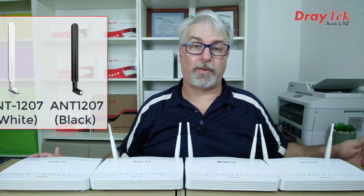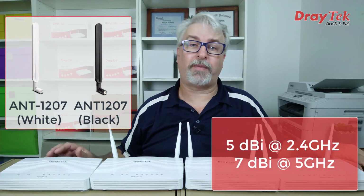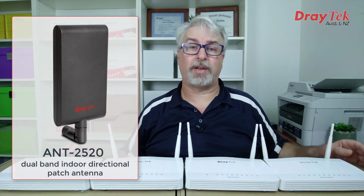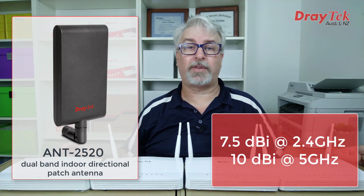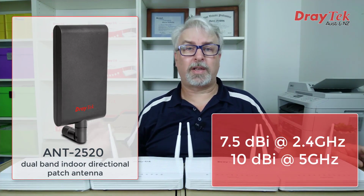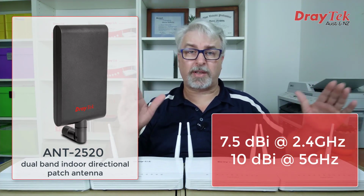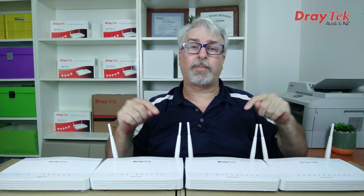DrayTek have the ANT1207 antenna available as a straight screw-on upgrade, which steps the gain up to 5 dBi at 2.4 GHz and 7 dBi at 5 GHz, as well as the ANT2520 dual band indoor directional patch antenna, which steps gain up even further to 7.5 dBi at 2.4 GHz and 10 dBi at 5 GHz. Just bear in mind these are directional though, so you'll only see an increase in distance in the direction that they're pointing. In all other directions the signal will be worse. I'll include a link below to the specs of these two for further information.